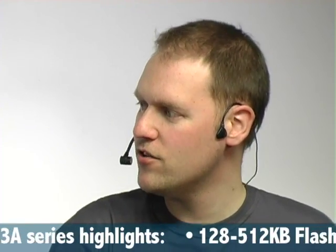Speaking of product lineup, we need to address the current roadmap for the UC3. The first round of launch will include two series: the UC3-A series and the UC3-B series. On the A series, you'll find a device with 128 to 512 kilobytes of flash, up to 64 kilobytes of on-chip SRAM, and a USB-On-The-Go interface and Ethernet interface. The UC3-A series will be available in two package options: a 100-pin TQFP package and a 144-pin TQFP package, where the extra pins give you an SRAM and SDRAM interface.